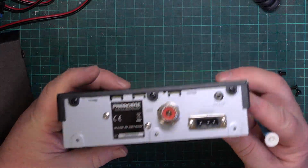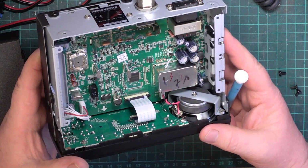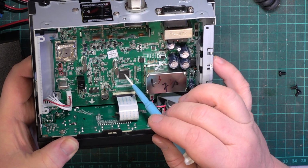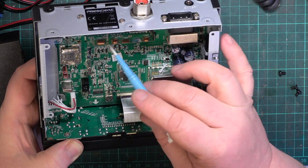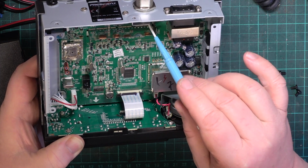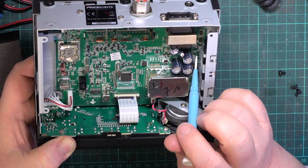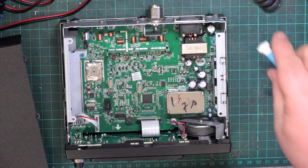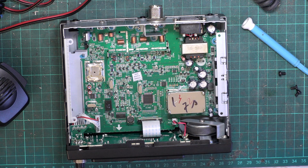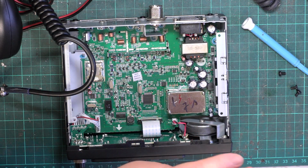So we've got a crystal for the reference oscillator and 2 other crystals. So that's a filter, and that's a reference crystal for the CPU. So we've got no adjustments in the receiver other than the detector, and we've got no adjustments in the transmitter whatsoever. But we're going to have a power control, which is probably RT402. So what I need to do, of course, is to see whether we've got a service manual on file, or whether I can find something about this. What I should have done is taken the power lead out of the little box.